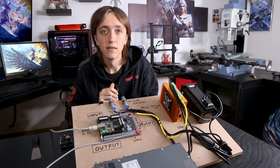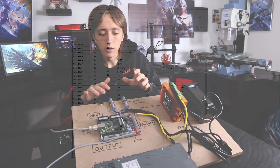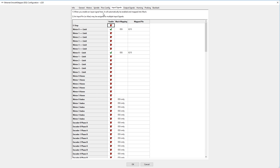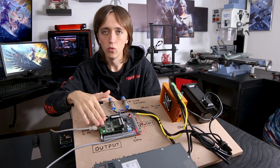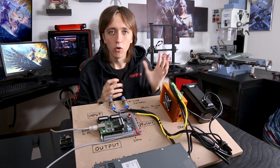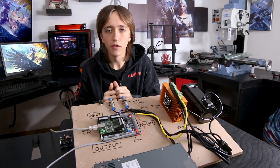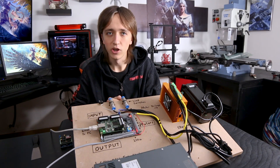Since I'm not a pro yet in using Mach 4, I won't show every little detail, but basically what you have to do is configure your different inputs and outputs — tell the computer which connection point has what connected, so for example which points have my X motor, where my limit switches are, and whatever else I have. Then you can start sending commands to the controller board. I hope this video cleared up a lot for you — if it did, please leave a like down below and consider subscribing so you don't miss my future videos about building my own CNC conversion. Thanks for watching and until next time!